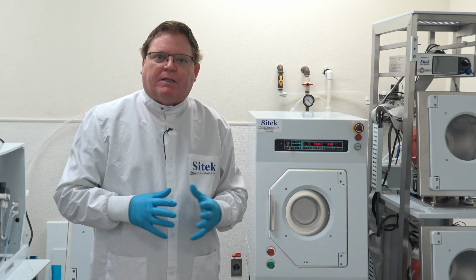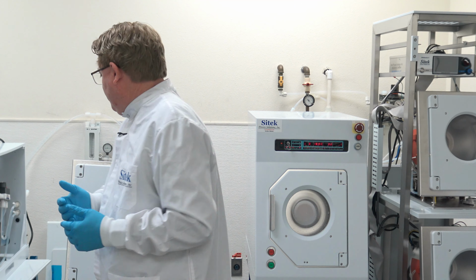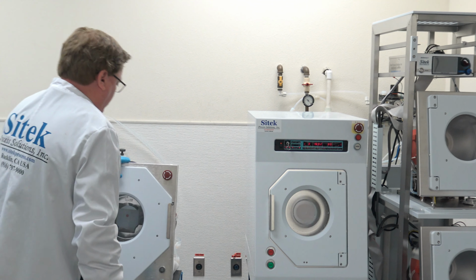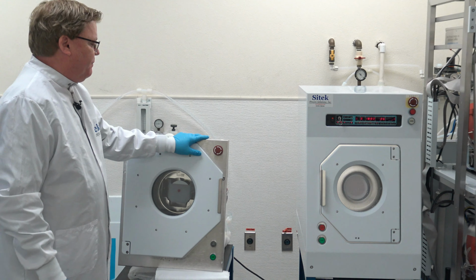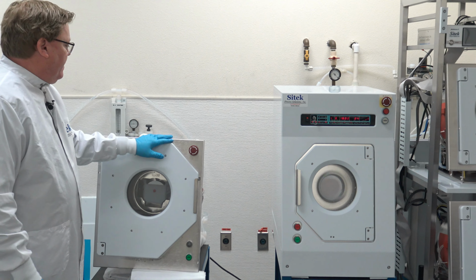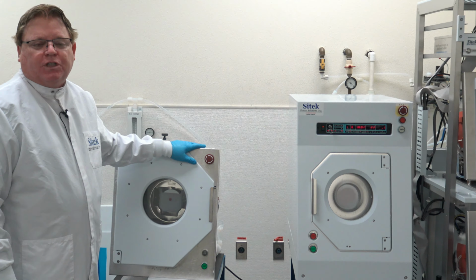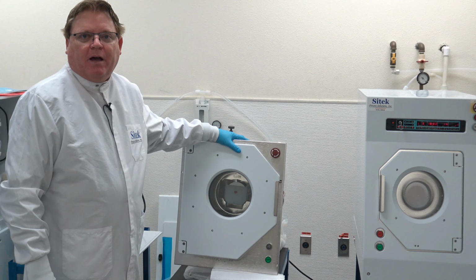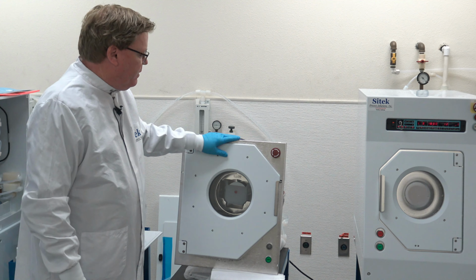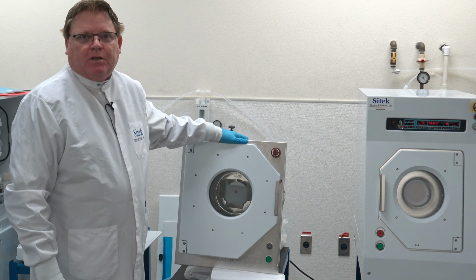During that rebuild process, it's in our dry manufacturing area. We rebuild the head up. It comes kind of like this. After it's built up, you can see there's no poly, there's no frame or anything. We do a dry QC out in final test. Once the system passes dry QC, it comes into wet QC. This is where we put the water on. We make sure all the valving's good, make sure all the fittings are good. We go through extensive DI testing. We have another QC here in DI testing.